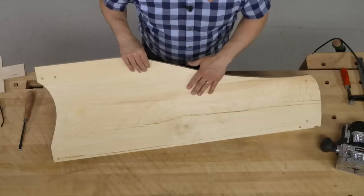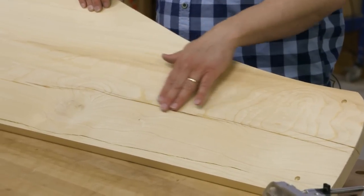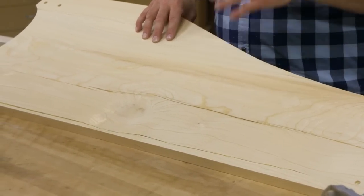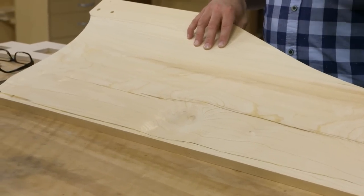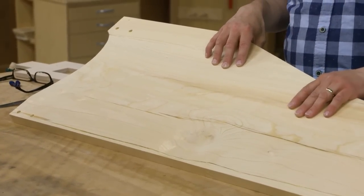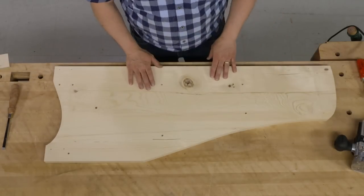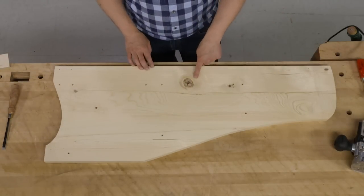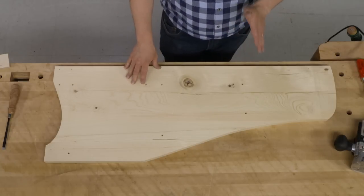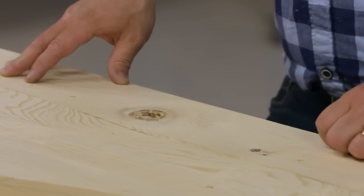For the most part, I've been able to work with the characteristics of the material. I got some nice looking grain, some fun little mineral streaks and little cracks in it, and I've avoided having to feature or highlight some of the knots that are often found in softwood. However, as you'll see on the inside of this side panel, I got a pretty big one right here. If it were solid, I might be able to let it slide since it's on the inside, but sending it through the planer caused some pretty bad chip-out.